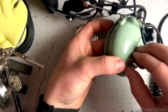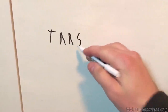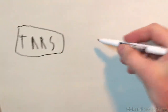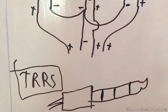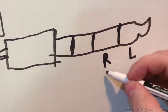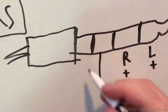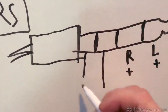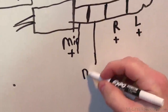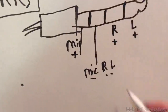The connector I'm trying to wire to is called a TRRS connector — a headphone and mic combined in one small jack. How we would wire this up: your left side is here, your right side of your earphone is here, and these are your plus connections. Now your ground — this here is the ground for your mic, your right ear, and your left ear. Those are all grounds there.